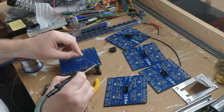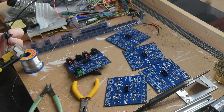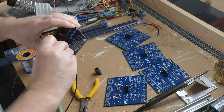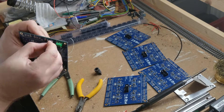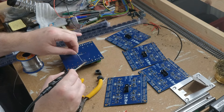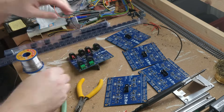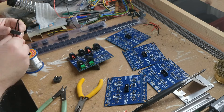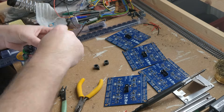I do have to fix that 10-pin connector that's the wrong way round. I have spares of those, so I don't have to try and extract this one and turn it round. I can sacrifice it, cut the plastic away, then desolder the pins one at a time, and then replace it with a new one. I assume that if I'd told PCBWay about it they'd have fixed it, probably by replacing it with a new board, but I need these in and working to progress the layout, and I'd rather fix this one than wait for that.